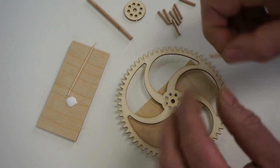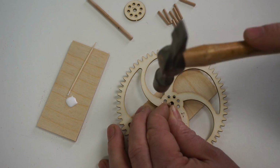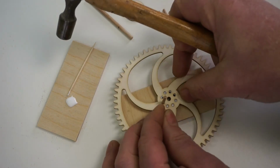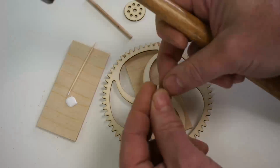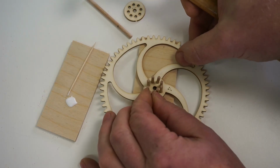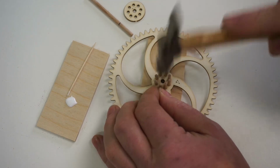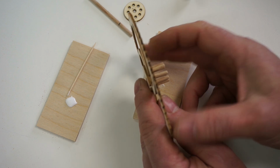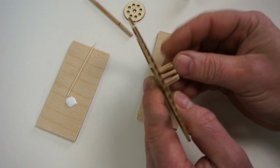Now tap the pins in. This may seem slightly brutal, but the pins need to go through a tight fitting 4mm deep hole. Just gently tap in until you reach bottom. The pins will be about as crooked and out of line as Stonehenge, so just tweak them to make the next stage a little easier.